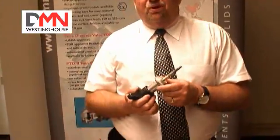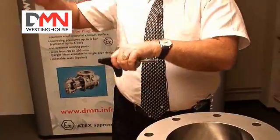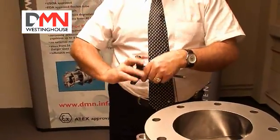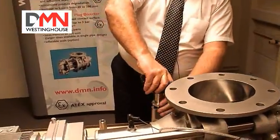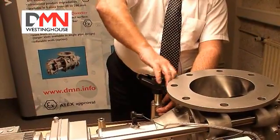Lastly, but not the least important part, put the T-bolt back into the holder to make the circuit complete so that the process operators can start up the process again. And if you operate the valve as demonstrated, then you will have years of pleasure without any problems of the rotor touching the end covers or any unwanted happenings with your valve.